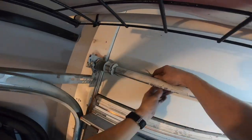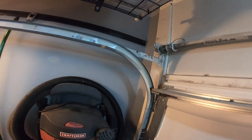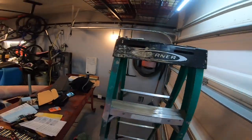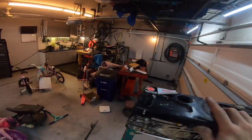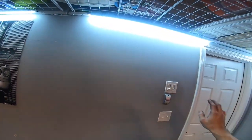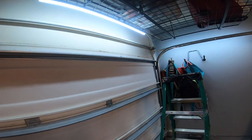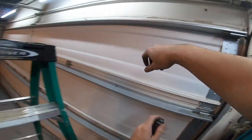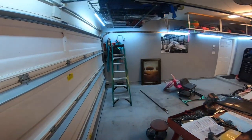When you're done winding, flip the switch back down on both sides. Then you're going to want to lift up the garage and see if it has any assist - if it's assisting you, you did it right. My garage door opener is in the way so I need to move that. Take the screwdrivers out and then lift up the garage.